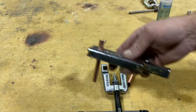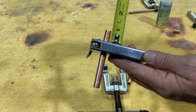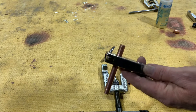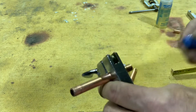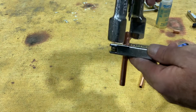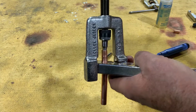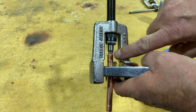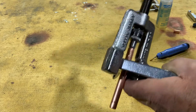I have my piece of copper set up in our block here. About three quarters of an inch is the perfect height for that. We always want to ream that out so that's a nice smooth entrance there. We're going to place our swage set up on there. Notice I've got to have plenty of room because I want this piece of copper to have room when we screw this in.